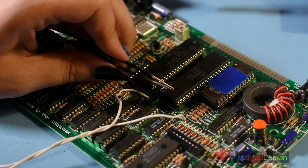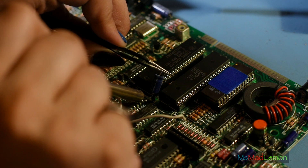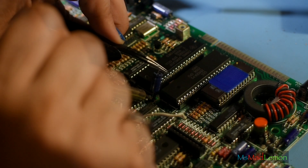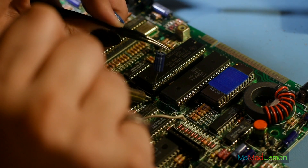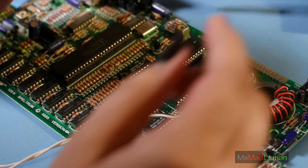It's better to add a little bit of solder first — just add fresh solder to it. It's much easier. There's one side and that's the positive. Just like that, gently pulling. Here we go, that's up.